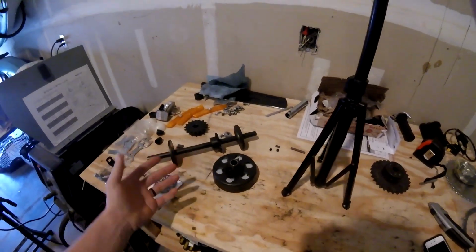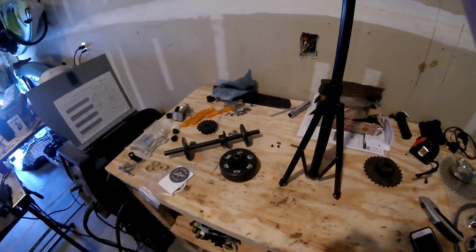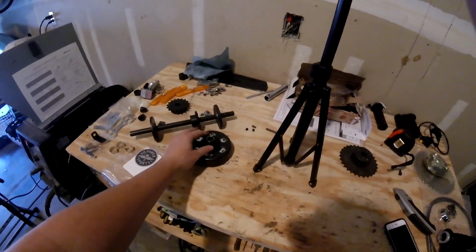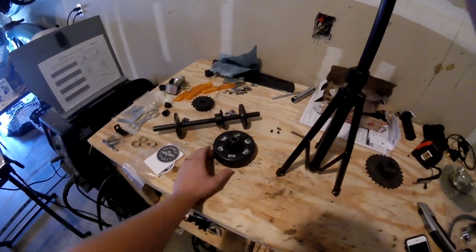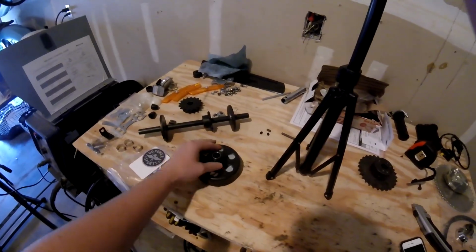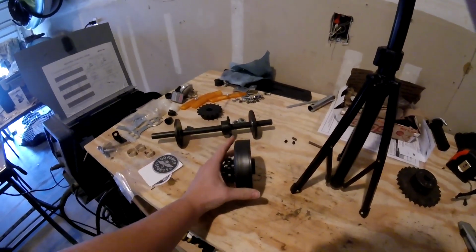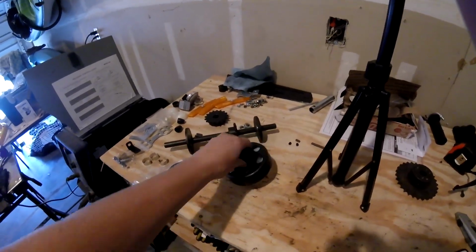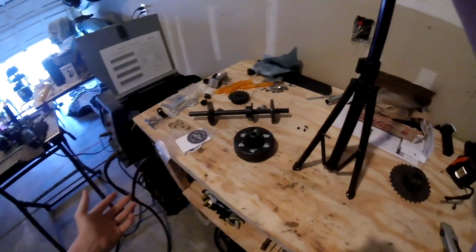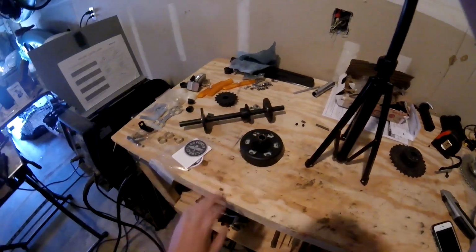If you're doing a project, whether it's a go-kart or mini bike, you don't want to use a cheap clutch. Again, cheap clutches being like $17 to $25, you want to avoid them. I never had a clutch go out on me, but I was just lucky. Usually the real cheap clutches go out pretty quick, within a month or two. Now I don't know if there's a bushing in here, or if it's needle bearings. Like I said, it spins real smooth. The drum looks a little wider too, versus all the other clutches that I had. There was a lot of play in all the other clutches. But for this build, I wanted to do something a little bit higher quality. So yeah, you don't want to use a cheap clutch. Just save yourself the headache and get a good quality clutch.